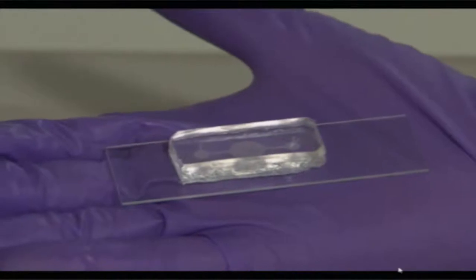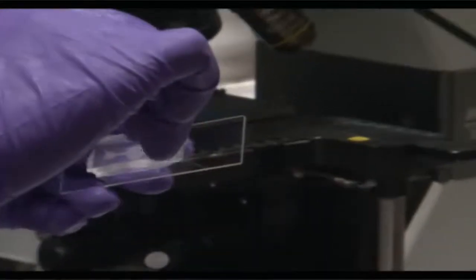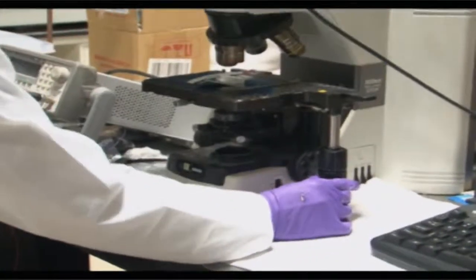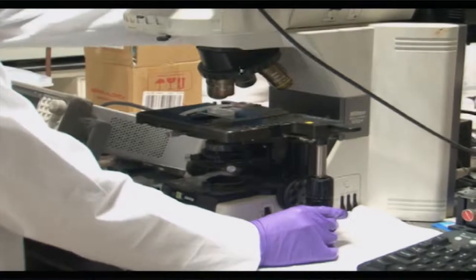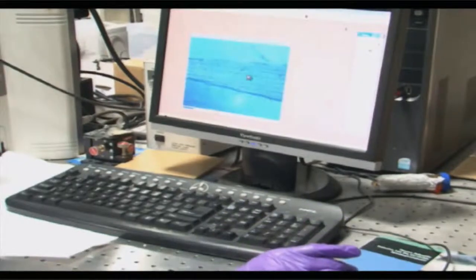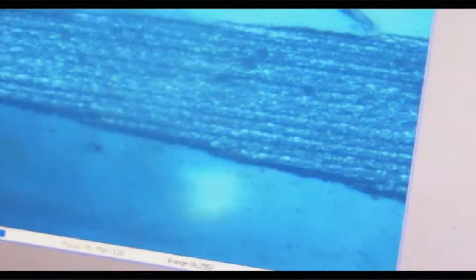Okay. So here we can do some characterization of this microchannel using a fluorescence microscope or in the optical field using the bright field option. So here you can actually see how this channel would typically look like. This is how the microscope has been focused onto this channel. Okay. So you can actually get some good images. And this microscope has a scale, so it can do some metrology as well. You can actually get a very good illustration of what are the various widths of the device which are obtained over this particular channel. So you can actually measure between any two places, on a scale which is definable by the magnification factor on the lens that you are using.